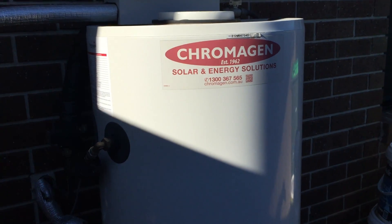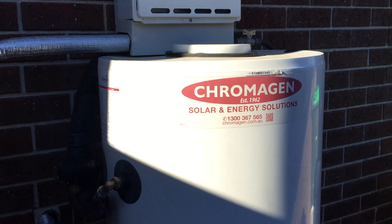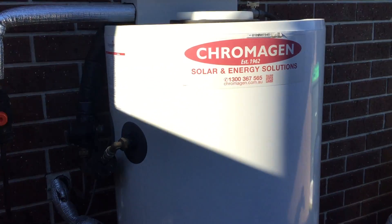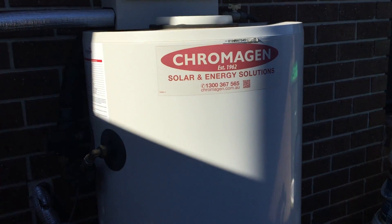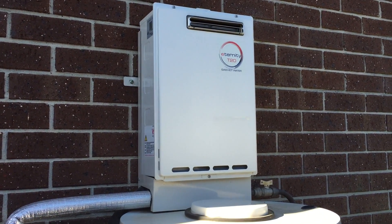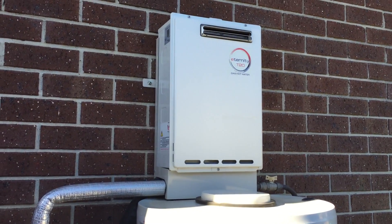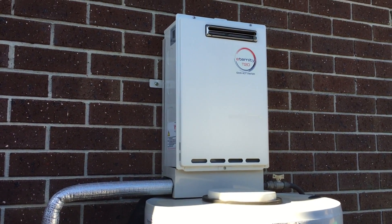The idea is that when the water's hot, this guy won't turn on - it'll just run through hot water. And then when this runs out, if you've had five showers in a row or something and there's been no sun to reheat it, never fear because this guy can heat your water. So if the solar feeds warm water in, the gas heater doesn't have to do much. And if the solar is feeding cold water in and there's been no heating, this gas heater has to do everything and has to warm the heater up. The downside of this system if you've got teenage kids is the hot water's never going to run out - it will literally never run out. That instantaneous heater will just turn on and run and always continuously supply your hot water.